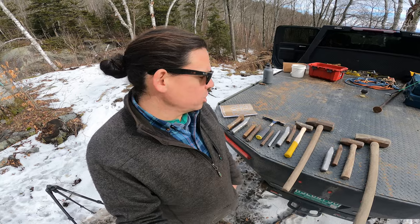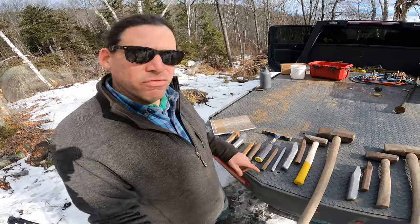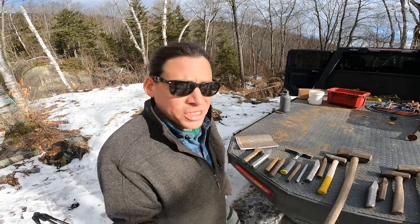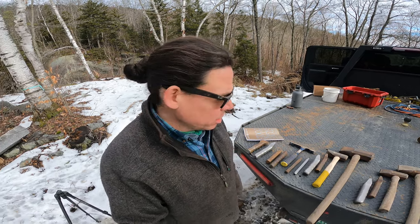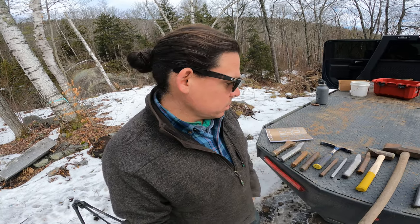I should note that Trow and Holden's tools are heat treated to very specific hardnesses — the hammers are slightly harder than the heads of the chisels, so as you work, the chisel head deforms rather than the hammer. I have a lathe in a little machine shop at home, so with a tracer like this I can chuck it up and turn off the mushrooming. It's really important to do that — this spring I caught a piece of shrapnel in my leg; I thought I hit a femoral artery, I bled profusely and quickly. It was a serious injury, so keep the heads of your chisels clean.